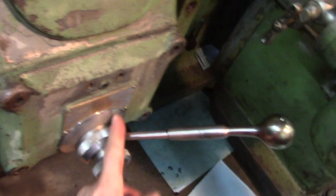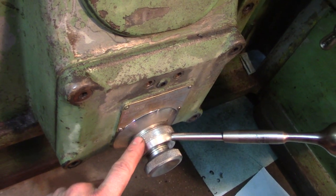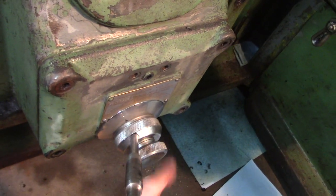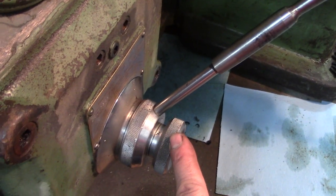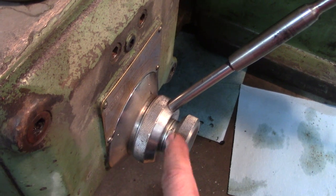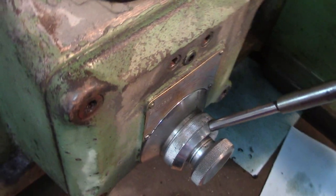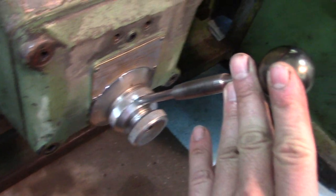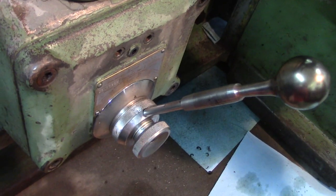So that's cool. And I put some of that CMD extreme pressure grease, it's really thick. I put some behind that dial, and this is the friction adjustment. And I think I put a wave washer in there. You're supposed to tighten it and lock it. I would rather have a spring washer to hold tension and then put grease behind here. And that's the sliding surface area. I know you guys can't do field of vision here, but it feels so smooth for the speed adjustment.